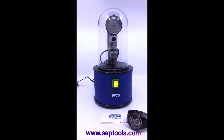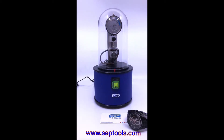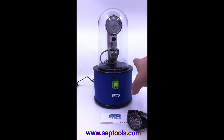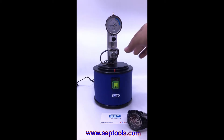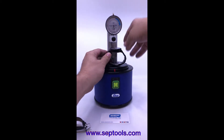As you can see, the dial is not moving to either side — not to the left or to the right. That means there is definitely a leak in that watch. If the dial stays on zero, that's the most definite indicator of a leak. Five to ten seconds is plenty and we see no movement — it stays on zero. So we've confirmed this watch has a leak. We press the red button and take this watch out.